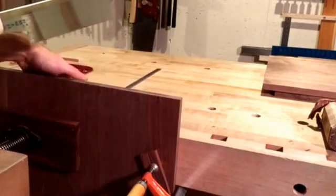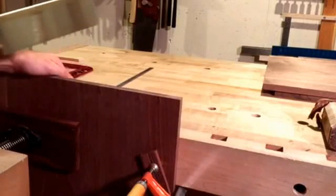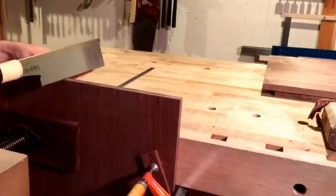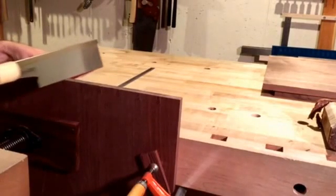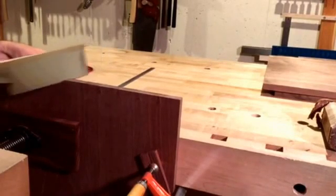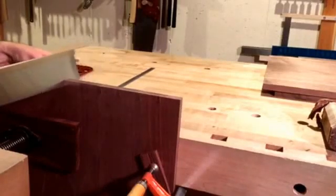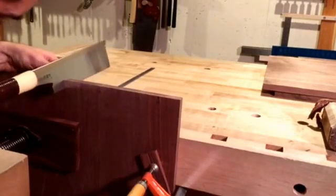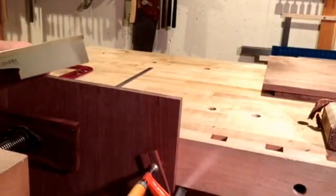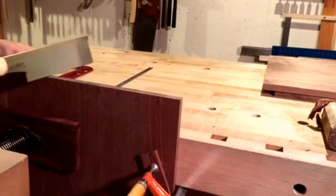If you intend to finish off the saw, it's important that the saw cuts are actually straight. If they're not straight, you're going to have to pare, because the transferred mark and then saw cut in the opposing pin board are likely going to be straight. The joint won't come together properly. So if you begin to stray off of your mark, it doesn't really matter. Just continue.